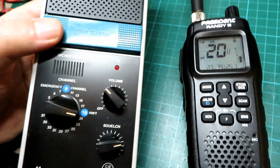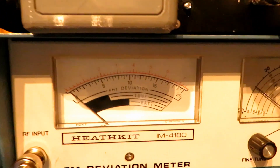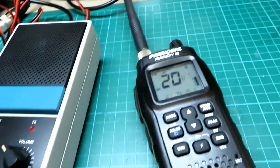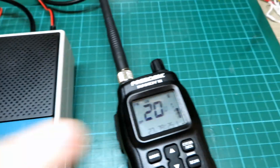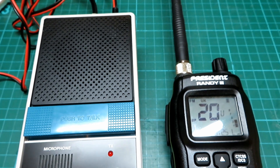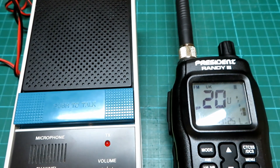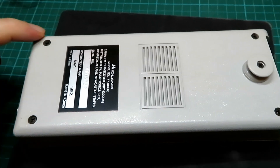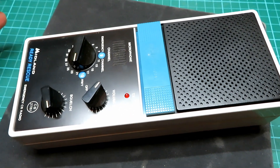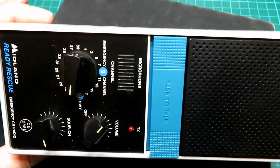Okay, we've hit the first snag. There is very very little to no deviation — we've got the deviation meter here and there isn't any deviation on that signal. The customer didn't mention that; they said both were working, but there's no modulation on this one. We'll check and see why that is. Before we even test receive, we'll take this apart and see what's going on. Just like the ZX1, it's four screws off the back and removal of the control knobs off the front to split it apart.